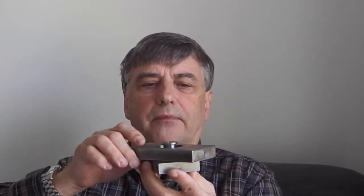In this video I'll be making another block that fits on top and a pin that goes through. The pin holds in the dovetail as well as locates in a bearing. This is going to form part of a ball turning attachment that you can fit on, that'll screw in and holds the dovetail on and the bearing swivel on the top.